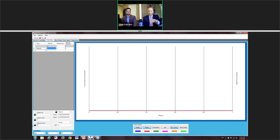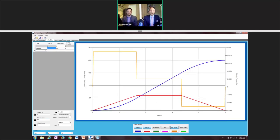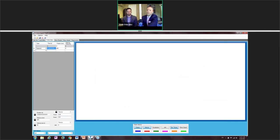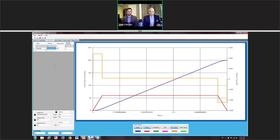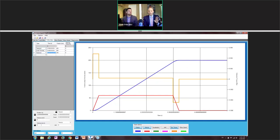In the Profile Editor, it's always good to have a forward and reverse move. We'll set up a quick trapezoid move. Switch the units to millimeters per second. We know the velocity is 60 millimeters per second and the travel distance is 200 millimeters. The trapezoid move divides everything into thirds, giving a 1.6-second acceleration time — a bit long, so we'll change acceleration and deceleration times to 0.25 seconds each to get up and down to speed quickly.